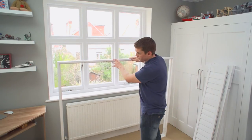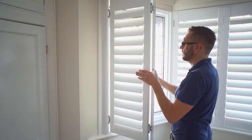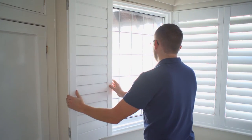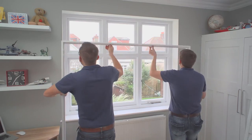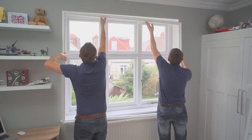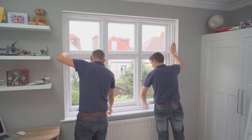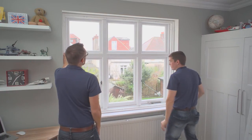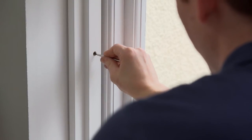Your frame has a hinged side and a non-hinged side. Think about how you want your panels to fold — for example, if your panels are folding to the left like this, you want the section on the far left-hand side. Hold the frame up to your window. Depending on the wall or window you are fixing to, you might need to drill fixing holes. Simply insert your bradawl or small screwdriver in the hole, mark the wall, and then drill.